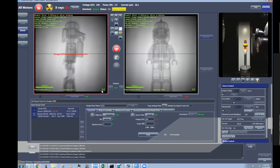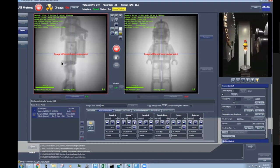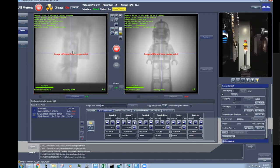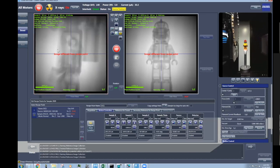If I move the source closer to our object, you can see it moving in the optical camera and the X-ray image changing — we're moving the point of the cone towards our object and getting more magnification. Now we can see the bottom of the X-ray window; we've zoomed in by moving the object towards the point of the cone, but we're seeing less of the object because he's starting to go outside the cone. Moving the camera back out, you can see we zoom in on part of the object as we adjust.